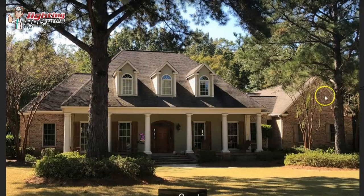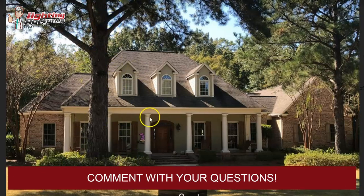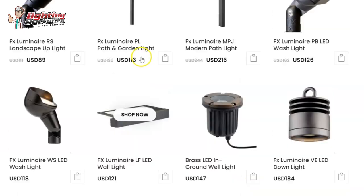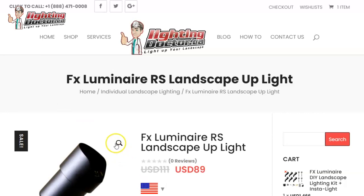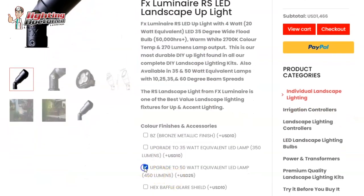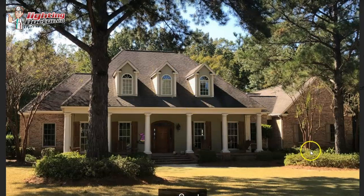You've got these big beautiful trees in the front — I would definitely try to get some up lights on those. For really big trees like this I like to put some extra focus on them with maybe two lights, one on each side shining up into the canopy. Depending on how thick the shrubs are around the base, you might need to put the light on a riser — probably a 12-inch riser — so the up light is sticking up just above the shrubs. When you get to trees that size, you probably want something a little brighter than the standard 4-watt LED; I would upgrade to a 50-watt equivalent, about a 6-watt LED lamp.